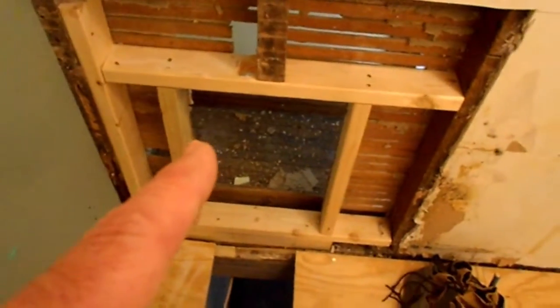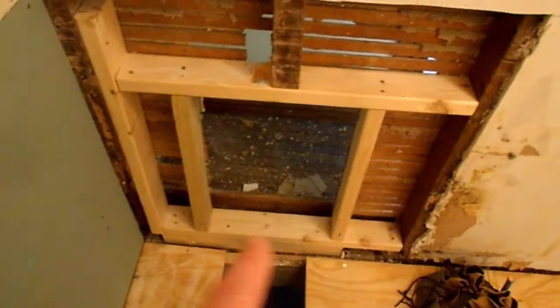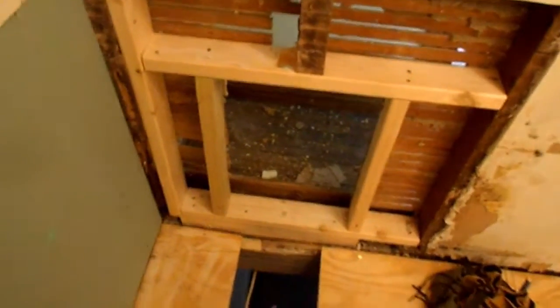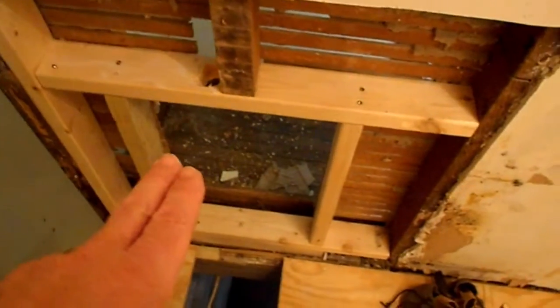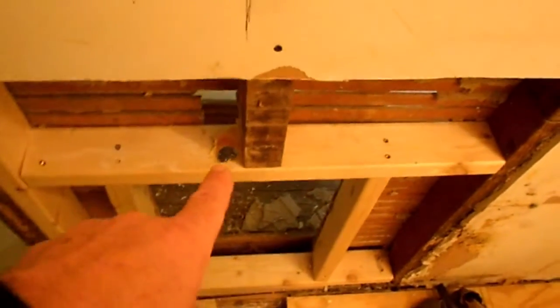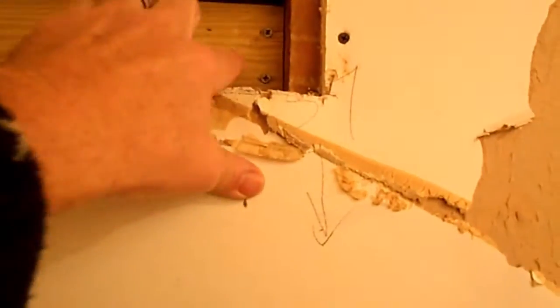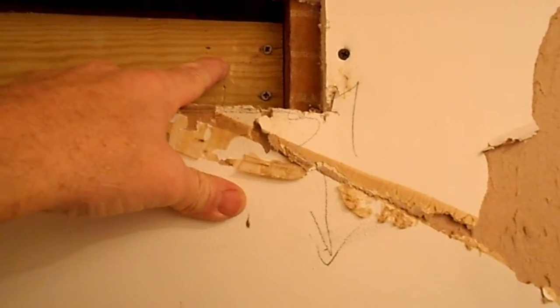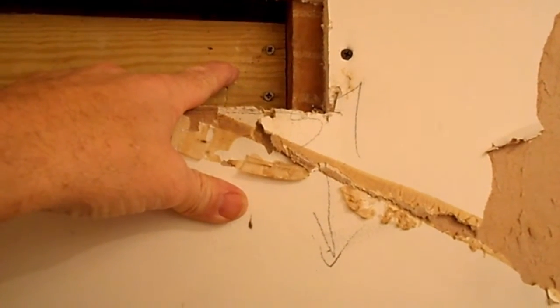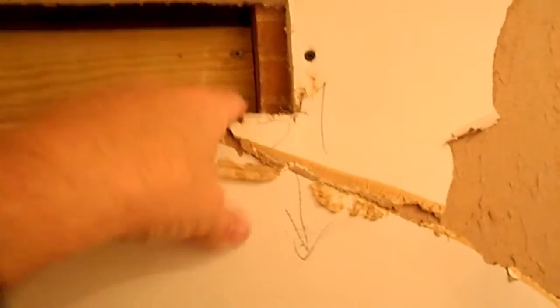But I wanted to talk about the old faucet and stuff, which was what was leaking, and it had leaked in the wall and ruined all this. So we had to reframe some of this. We tore out the bad stuff and reframed it. I'm going to show you how to put together the faucet set and how to install it. I've already drilled, and I've got everything kind of ready. I drilled a hole here because this is where the riser goes up, and then we'll mount the receiver here so that the shower pipe can be screwed into that. I went ahead and cut in here so I could put in a backboard. They didn't have that in there at all. All they had was the pipe shoved through.